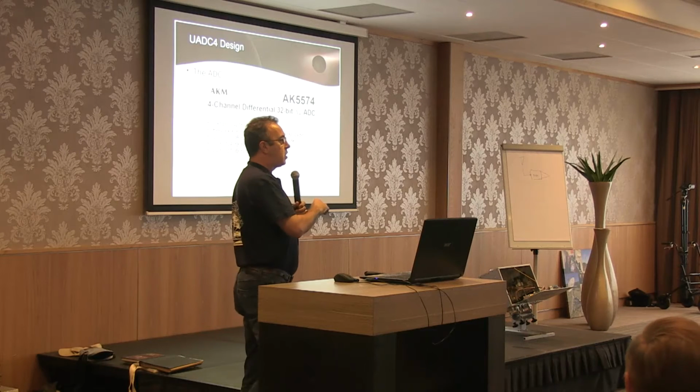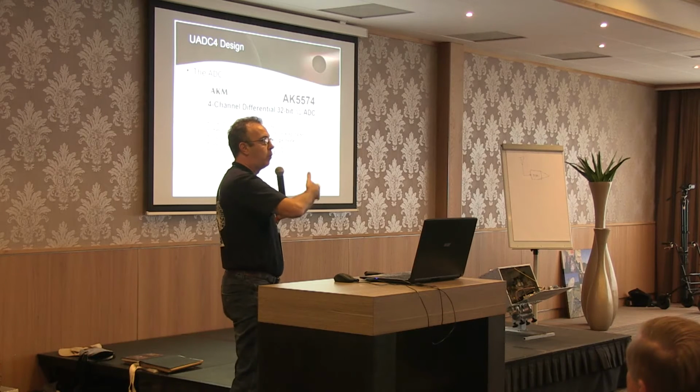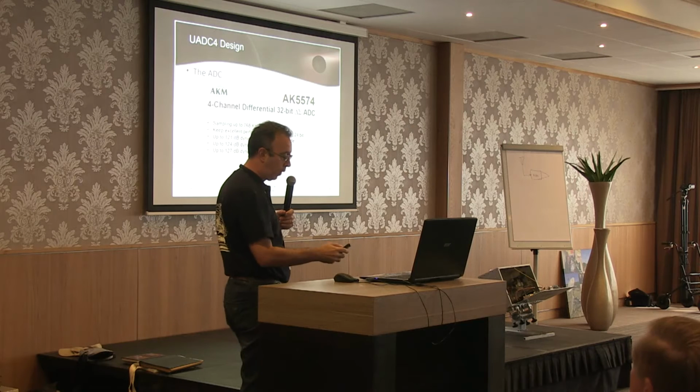But I selected that chip because I tested where this limit of 20 kilohertz is, and how it works in the different brands. In the other brands, after 24, 25, 26 kilohertz of sampling, the noise rolls off very, very quickly in the corners. That means it was not really usable for us. And for all those who already use audio cards for ADC conversion, when you increase your bandwidth, you see the response is not really flat. And that creates many, many problems with weak signals.